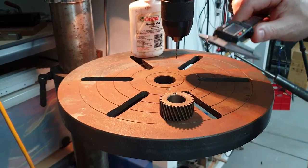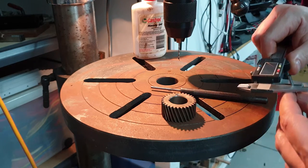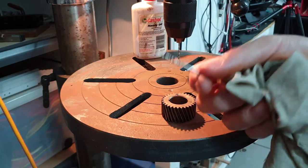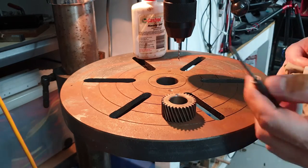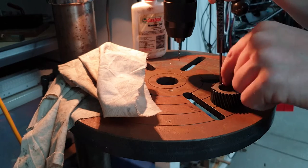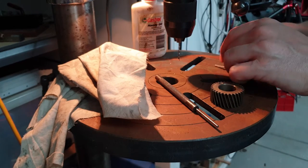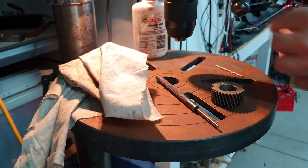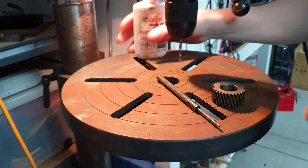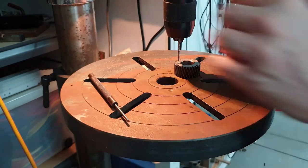Okay, so I don't have a 2mm pin punch, but I definitely have a 3mm pin punch, and I've got a 3mm drill bit. Now the fit and finish is not going to be perfect because these aren't machined. This is definitely not a tapered reamer. This is definitely not a machined pin. So it's going to be close enough. Hopefully we can get enough squeeze down in there. When this is full of oil, we'll then push the oil down, compress it, and hopefully push the pin out of the hole. It does not feel like a super tight fit, which is a bonus, but it's a trick I'm willing to try. Let's see what happens. Easy does it. Slow and steady wins the race.